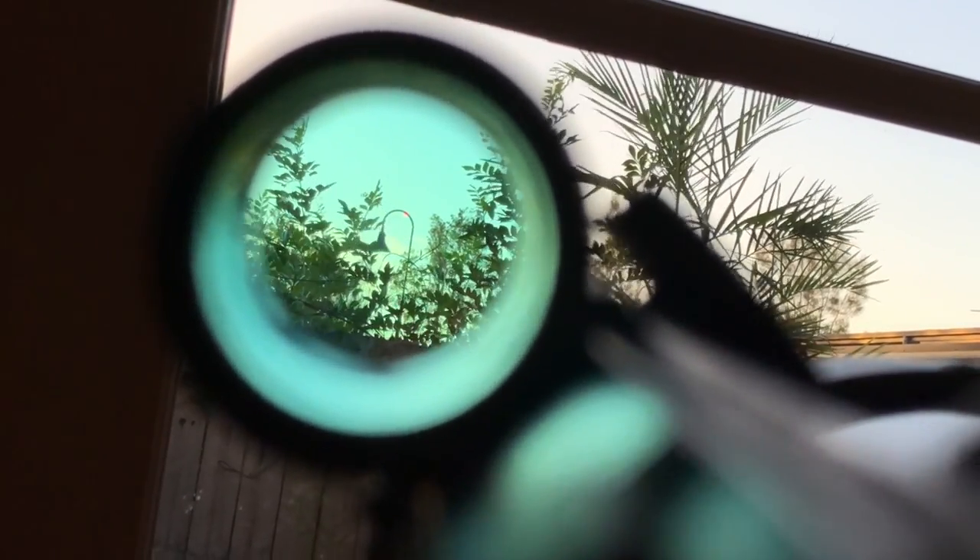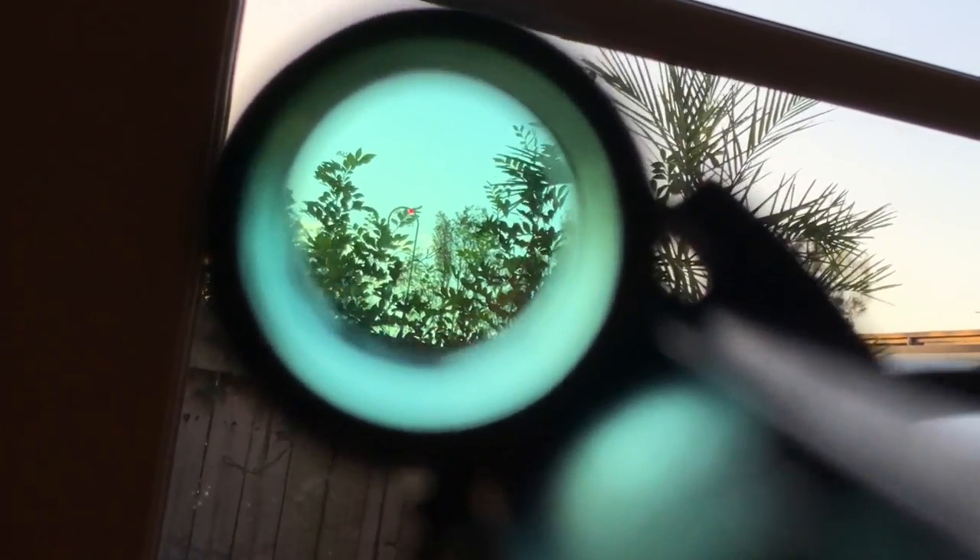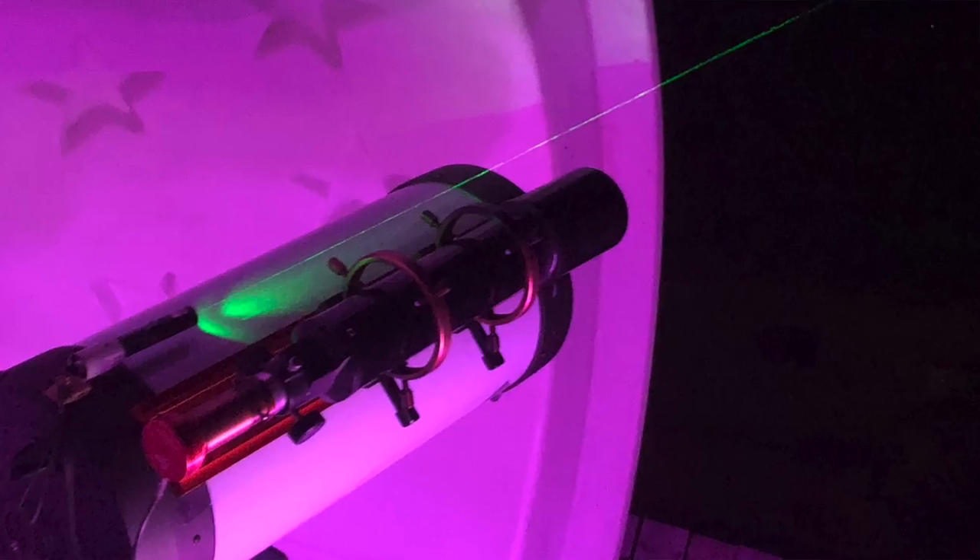What I'm going to show you today is how to make a laser finder. This is to replace a traditional finder scope. You might be familiar with the smaller red dot finders on many telescopes, and also the finder scope which is sometimes awkward to crane your neck to look through. A laser finder is another idea where you stick a laser on the telescope running directly in parallel with the scope optics itself, so you're pointing straight at what you're trying to find. This means you can use the hand controller to find that thing in the sky without having to look through an eyepiece or finder scope — you just look at the laser and point it to where you're going, and then it's going to be roughly in the eyepiece or in the field of view on your screen.